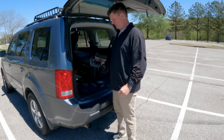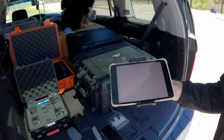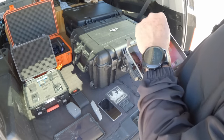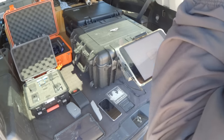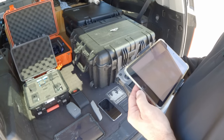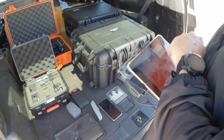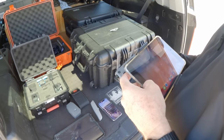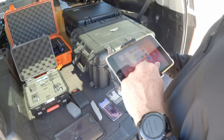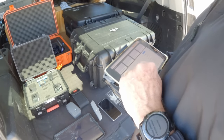All right, come on, DroneDeploy. And we're going to bring this in. Maybe, just maybe. You can see part of it. We'll see. Let's try it one more time. Flight. The problem is, this is an 18-minute flight. I'm going to run out of my battery because it's not starting. You know why? Here we go. I know why. Turn Wi-Fi off. I was connected to my Rover, which does not share the internet access, and so therefore it couldn't log on to DroneDeploy. Okay, photogrammetry tutorial, here we go.